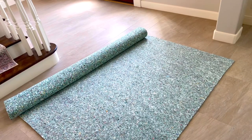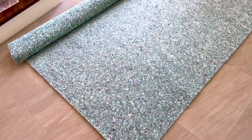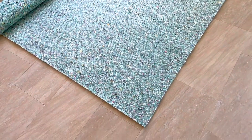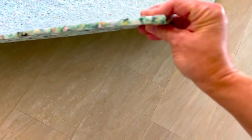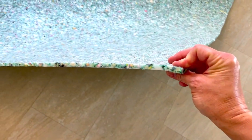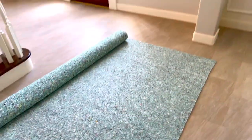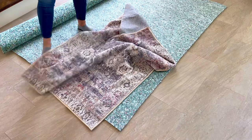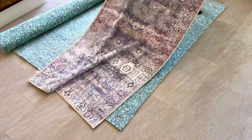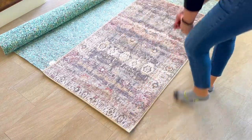Tip number three is to buy actual carpet padding to use underneath the rug on your stairs. The carpet padding is going to give the thickness and softness you need to make that carpet feel nice underfoot, and it's also going to give it the perfect plushness or roundedness that people like when they look at rug runners on stairs. You can get this at Lowe's, Home Depot, or your local hardware store — it's usually on the shelf next to the carpet. This is a six by nine foam carpet pad, and it was way more than enough to do the upper and lower part of my stairs. All you're really going to be covering is the tread itself that you walk on.